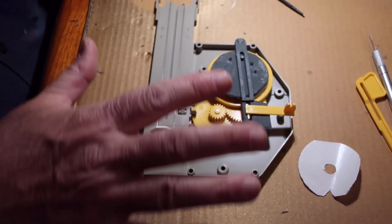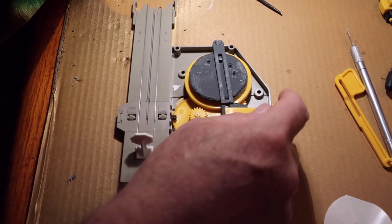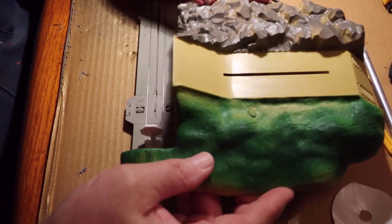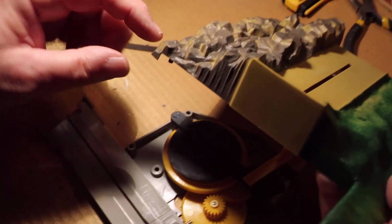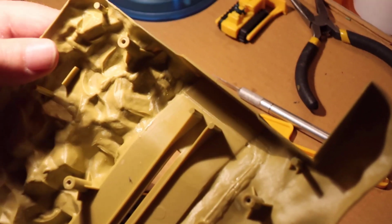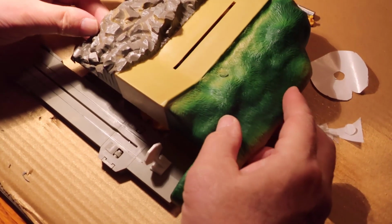So I've got the tractor axle grabber, I guess that's what I'm going to call it, somewhat in place. And as you index this, this lip here is going to come really close to here, and then this edge is going to remain parallel to here, and that will index those pins, the alignment pins underneath it, the ones that are so much fun to deal with.